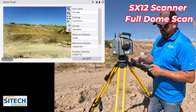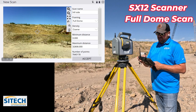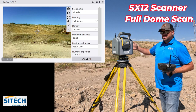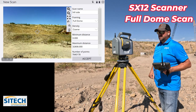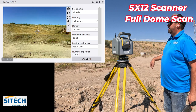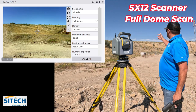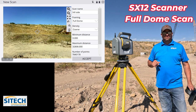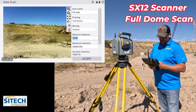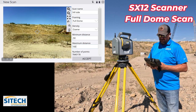Now, going down through that list on the density, you've got to be really careful on this one. You've got coarse, and if you leave it on coarse and then go to minimum distance, you can tell the total station a minimum distance to take a shot and a maximum distance. This one's a little bit hard. Sometimes on the maximum, you don't really know exactly how far that is. But if you know that you've got buildings or something way in the distance you need to get, overshoot on this number. I'm going to put in about 1,000 feet because the dome that I'm going to shoot over here is going to shoot out quite a ways. But for minimum, I'm going to put 0.50 to 6 inches. Maximum distance, I'm going to put out about 1,000 feet.